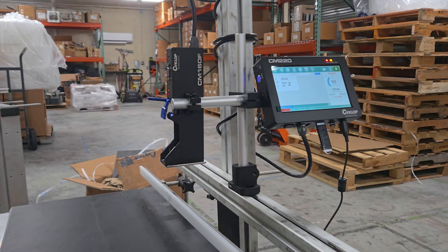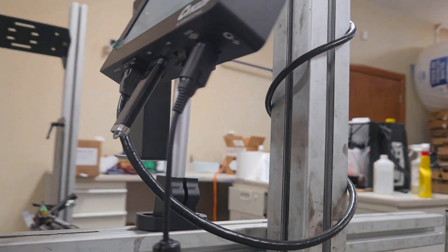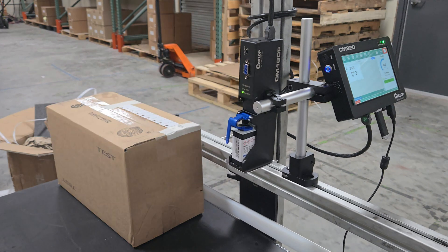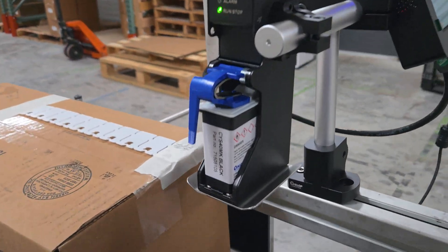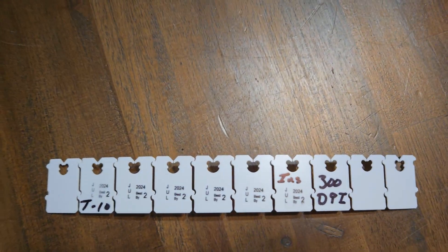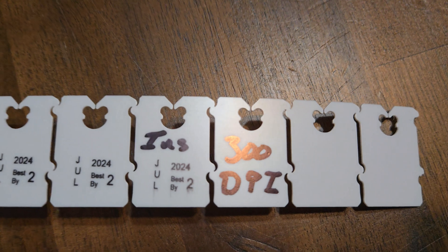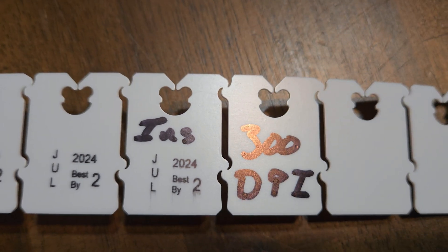Here's a video of how we tested this unit. It's really simple to put together — connected with a bunch of rods, thrown on a piece of aluminum with a flatbed conveyor next to it. We took those quick lock tabs, put them on the top of a box, and ran that through. We used the internal photo cell on the CM-160 to get our trigger, and told it to print every 20 millimeters after triggering so we could get a bunch of prints on the tabs. We put these samples through the ringer. On the INS test, that means we instantly wiped — I stuck my thumb on it to try and see if it would smear. Zooming in, we can see a little bit of smearing.